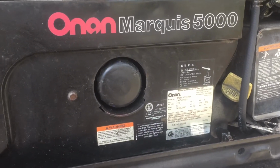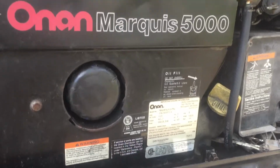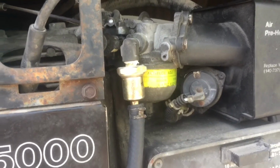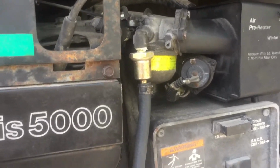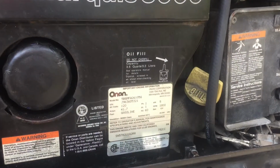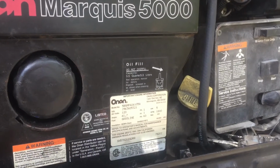And I found a lot of different people offering solutions like changing the oil level and cleaning the carburetor, which is over here, and the filter, and I did all of these things actually. I cleaned out the carburetor, I put a new fuel filter, I put a new fuel line on, and I changed different levels of oil, fresh air filters, the whole nine yards, and nothing made a difference.